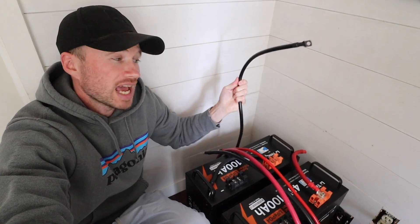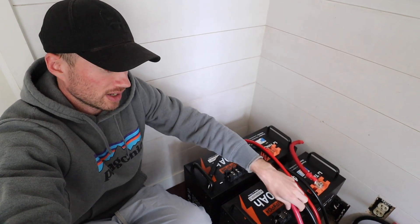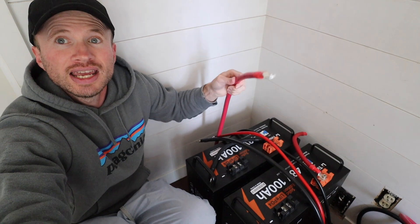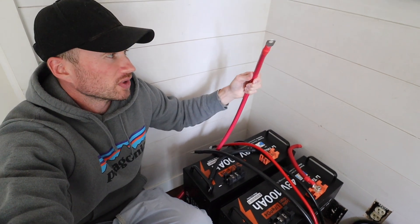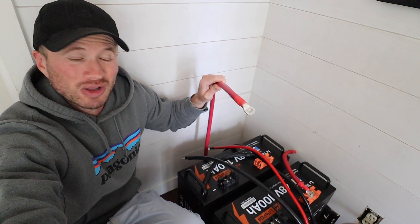It's not ideal to be using this smaller gauge cable, but in the circumstances where I need to get this job done and make sure the batteries are all good for this review, I did check with my solar consultant and he did say it is okay — though not ideal — that I won't be drawing too much juice through there where it's going to create an issue. So for today I'm going to proceed with the smaller gauge cable and continue my search for the larger 2-aught cable with maybe a smaller lug on it.